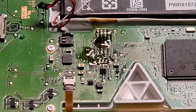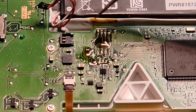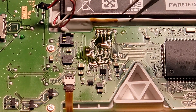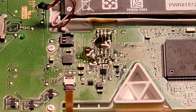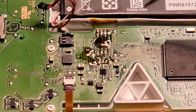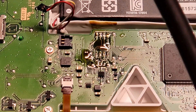I'm just going to apply heat to the chip here. I did manage to get it off, but if you notice up here — let me turn my heat gun off — I melted where the battery is a little bit. You just want to be very careful of stuff like that. I forgot to disconnect the battery, so make sure you disconnect the battery. I would recommend taking the battery right out of the Game & Watch entirely, because I totally forgot about this. I'm pretty new at doing this, so I'm learning as I go.